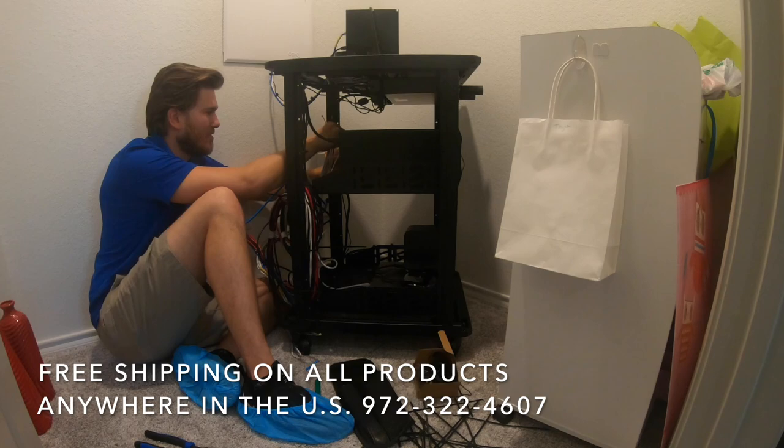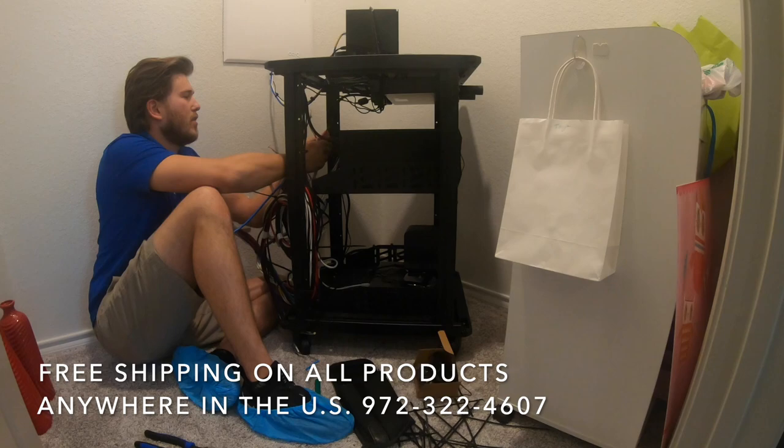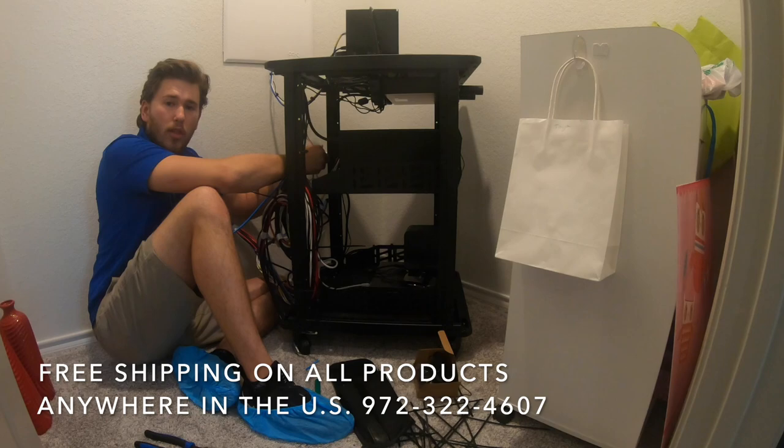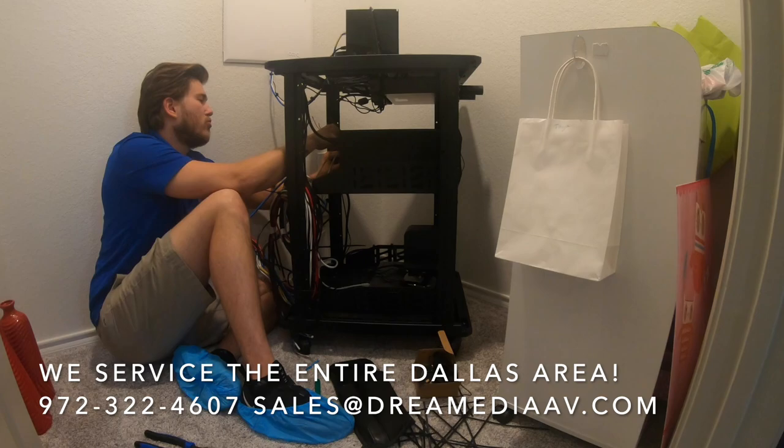Normally this is Grayson's job, but what I'm doing is we've just toned out all of our speaker lines and we are connecting it into the amplifier. And basically just toned all of the seven channels and we're putting them into the terminals. Not a whole lot to it. We've also made connections for IRs to the devices and the projector. We had to splice that one in using the Cat 6 line. We just used two strands and we're using the Harmony Pro system.